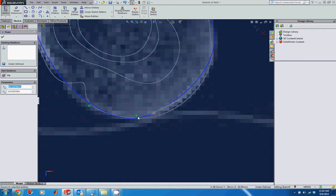And if I want to, I can move this guy as well. And I can also delete this constraint if I want to pull that off. And then I can move it a little bit closer. And again, that snap is a function of the visual distance, not the actual distance between the parts. So as you zoom in, that snap will get less sensitive. That looks okay to me. I'm going to move this guy out a little bit more too, again trying to look in line with these previous ones as well as this last one that I did. I think I'll take the constraint off that as well, just so I can pull them out a little bit more. That looks a little bit better to me.